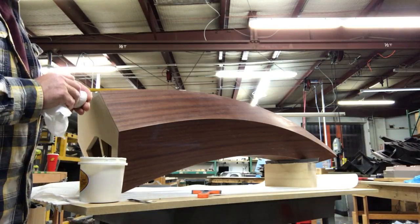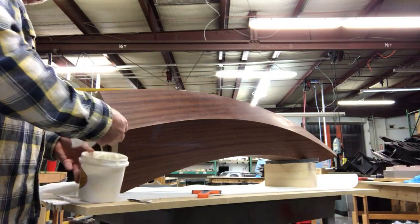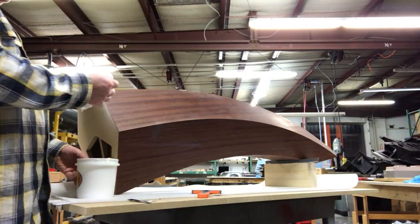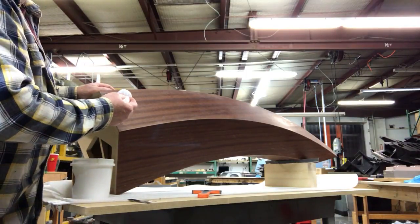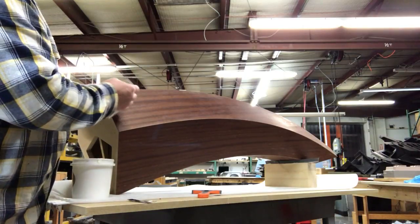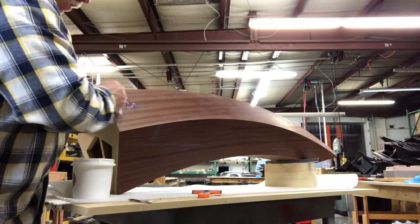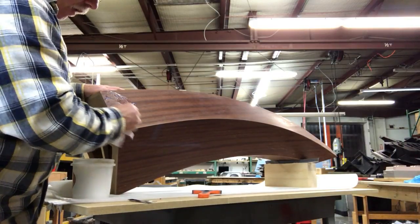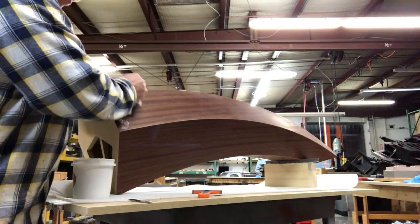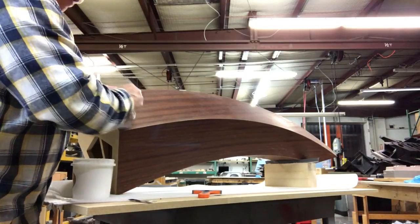This Crystalac will tend to dry out pretty fast if you leave the lid open. So once you're done applying it, I get the lid back on as soon as possible. I put it on basically in a wax on, wax off method, kind of waxing it across the grain. You want to push it down into the grain. Be sure after you've sanded the enclosure or whatever it is you're grain filling, that you blow all the dust out of that grain before you start this method.